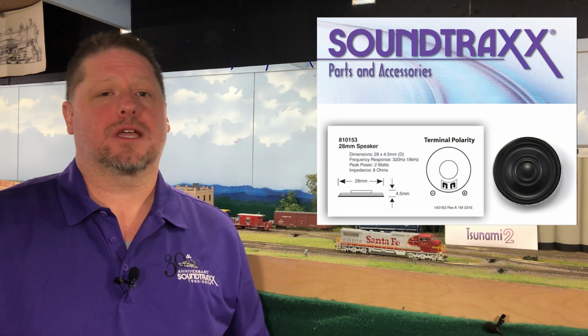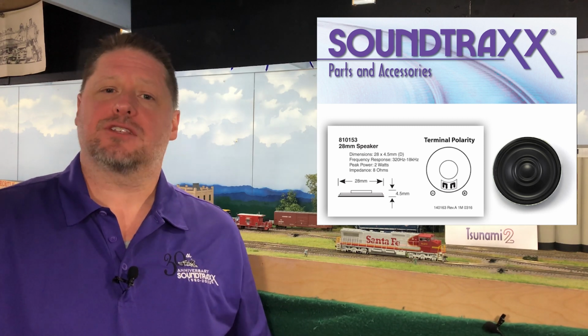With Tsunami2, we've improved the audio quality of our recordings and the digital playback of those sounds. Now, one of the biggest limiting features whenever you're doing a decoder installation is the type of speaker that's being used. This is where you want to look at the wattage and the frequency range of that speaker and its physical capabilities. A lot of the speakers we use in our small models tend to be tweeters by audio standards. When you think of bass and subwoofers, you think of big giant speakers, and that has to do with the wavelengths, because lower frequencies need a much longer and deeper speaker travel to be able to reproduce them. So when we get speakers into our models, we really can't get that low end like we'd want.